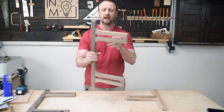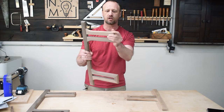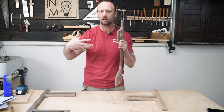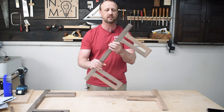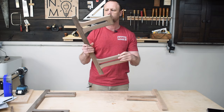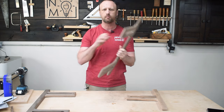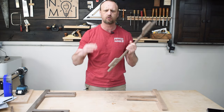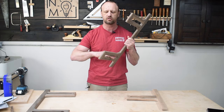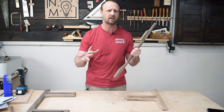After some sculpting and sanding, the brackets are done and I really like how they look. They have a really soft look and a soft feel, and I think it's going to look really cool with the shelf because the shelf has all these straight lines — it's going to be a good contrast. On the back I put two keyhole slots to hold it on the wall, and I put a hole on the bottom of each shelf bracket for a screw. I went back and forth on what to do to connect the shelf to the bracket, and I thought — keep it simple. Just a screw in the middle so the shelf doesn't wiggle around, because I do reorganize and want that flexibility.